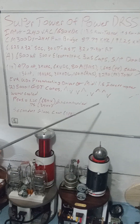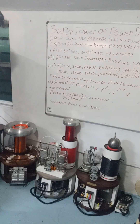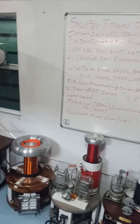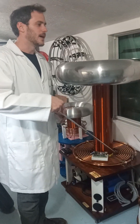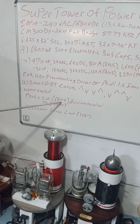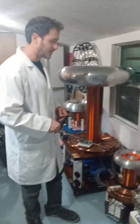Either way your phase is set on your driver, depending if you have a phase switch on there. This coil is water-cooled as well, and we'll be going through a more in-depth walkthrough on this too. The proximity from the primary to the secondary is one and a quarter inches, which gradually spreads out as the inner turn goes around to about 1.5 inches before you hit the next turn. At 680 volts, 1.5 inches is the most you'd want to go in, because you have the chance for arc-over from your secondary down to your primary.